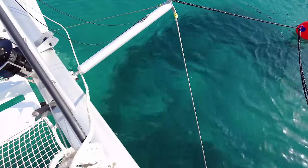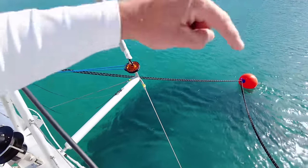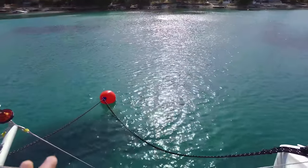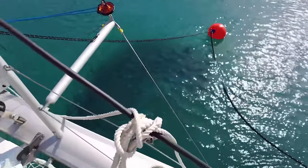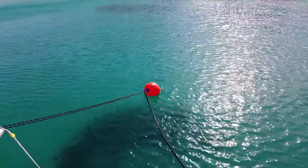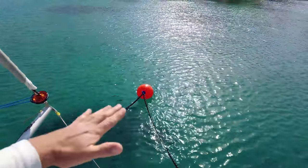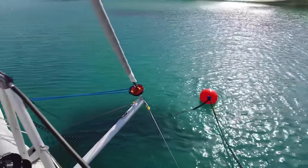Having your own anchor is much better because you will drag slowly, so you can wake up during the night and check. When the buoy snaps, the anchor will slow down the drift. Just drop a little bit - like twice the depth - and make sure the boat isn't going to be swinging around. Tonight we had a southeast wind forecast called Yugo in Croatia, so I knew the boat would stay here.